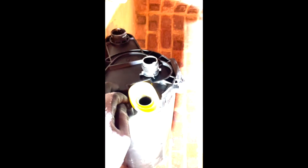I'll position it there. That's all we have to do — pop that, pop that one, and pop that one. Pop that off. It snaps easy because it's quite brittle. So that's the piece that sits down inside the boiler with the screw that basically connects it to the boiler. And then inside, this would be the bottom of the sump, and then the bottom of the flue way really, where it goes up. You can unscrew that bit, and inside there is the sump basket.